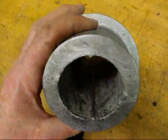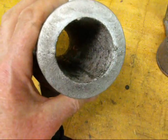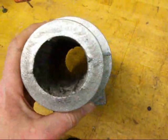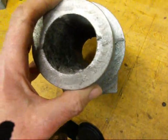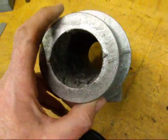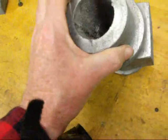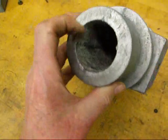And here's the hole. You wouldn't want to drill and bore a hole that big from scratch — that's why we cast the hole in there using a core. Also, if this was solid rather than tubular you would have shrinkage like you would not believe, and that would be another 3, 4, 5 pounds of aluminum required.